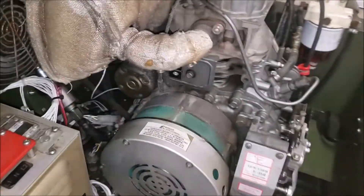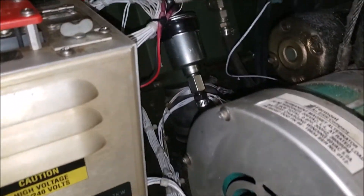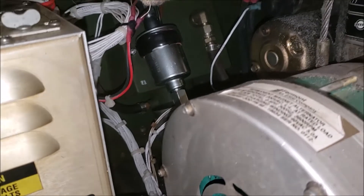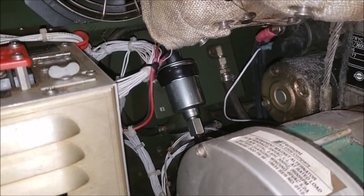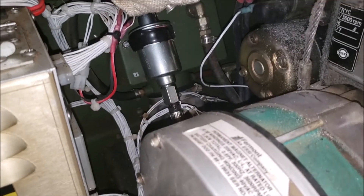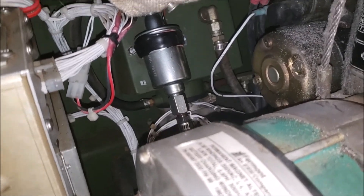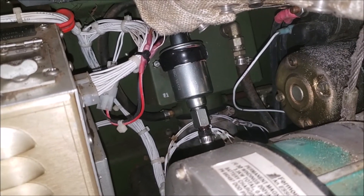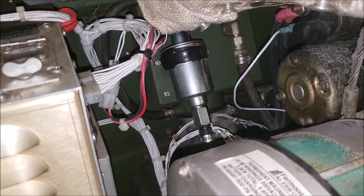I tested it and it does move fuel. It's a little more noisy, but who cares — I think it's more noisy because it's touching the 90-degree fitting up top. If you're going to copy a similar setup, instead of using the existing hole, go maybe half inch or three-quarters inch lower and bolt it there so you have a little more room up top.